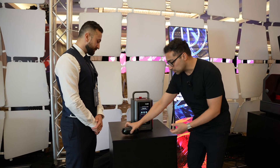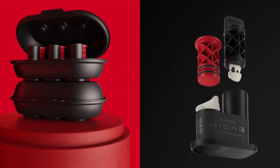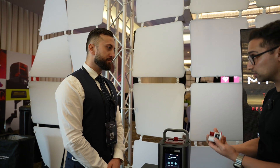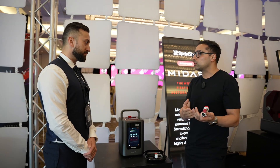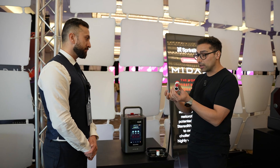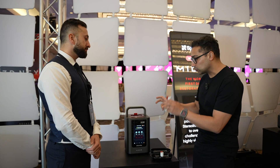Everything is now packed into these capsules right here. These capsules include resin, resin tank, and print platform — everything packed into one thing, which makes it very simple. There are no limits on viscosity anymore. In dentistry, when you add fillers and extra ingredients to make the resin perform mechanically, it gets very thick and becomes difficult to print with a conventional 3D printer. So we came up with a new idea: you force the material through channels inside the capsule and project light at it as that happens. You press it down and it flows — it's like a digital press.